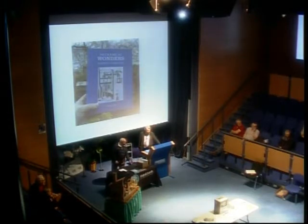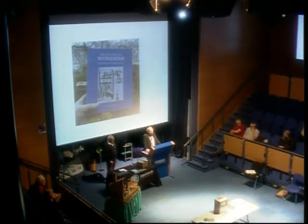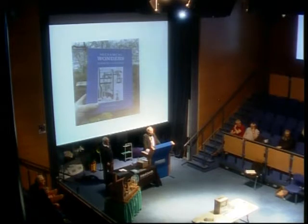And that is rather like Watt's condenser. So it was able to immediately double the pressure differential because it was really condensing properly. Whereas, of course, the Newcomen engine, to get a reasonable speed, couldn't drop the pressure below about half an atmosphere. But as David says, you are really on the limit. And if you want to use scale size valves on the small engines, it's exactly the same as with IC engines. If you get hold of a small petrol engine, you realise that the carburetor has a hole through it the size of your little finger, although the scale size would be a 16th of an inch. So scale factor is really quite critical on a lot of these as you move down. And it's wonderful that David manages to work these on compressed air or vacuum, because in some cases even that's a bit tricky.